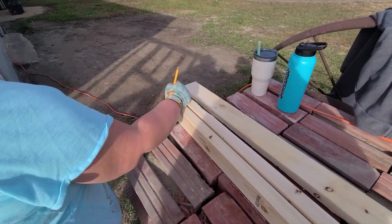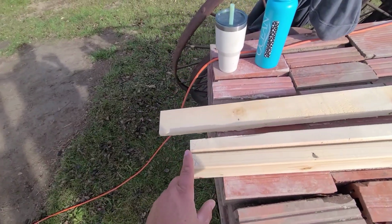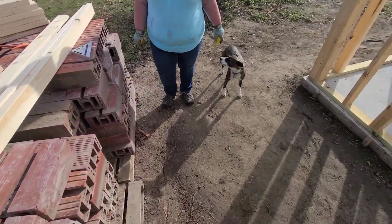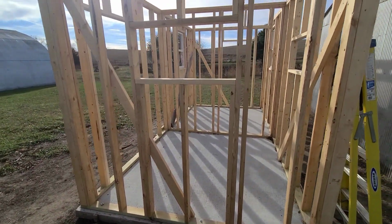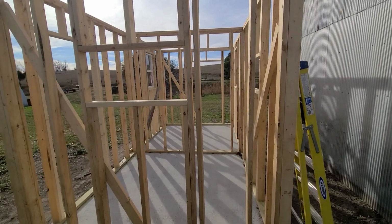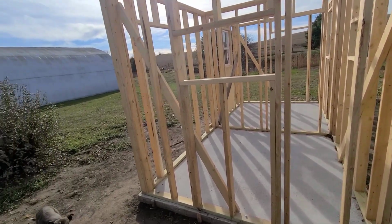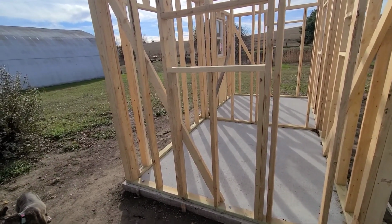She'll start there first. So she's going to do the same on the other end. So you get a stud just lined up right with the outside of this. So now we have to lay out for our standard studs. This is a 16-inch layout. Here you can go 2 feet as well on an outbuilding. So let's do 16 just for good measure here.